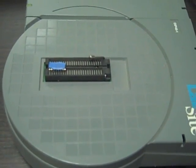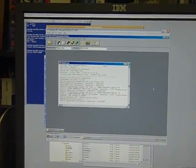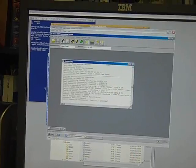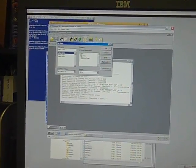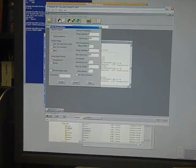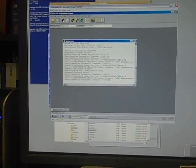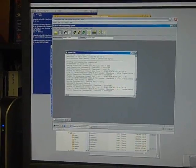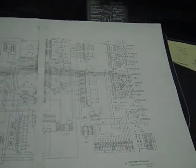What I'm doing is taking the color PROMs and throwing them in my programmer. I have the known-good contents from the main source, loading them up into the programmer, and it'll read the PROM and make sure they match. This chip is located at 7E, so we'll go ahead and read that in and do a verify. I'll do the rest of the PROMs to confirm whether the data is valid or not. All checked out okay, which is good — that takes them out of the equation.